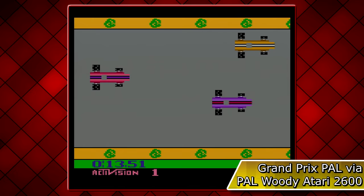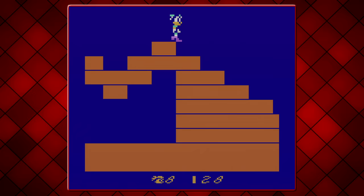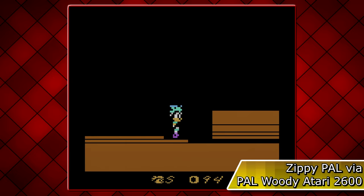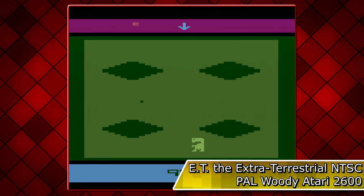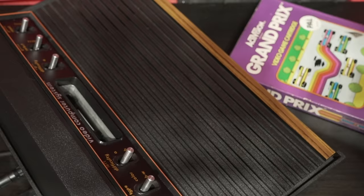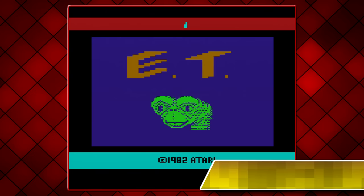It appears that putting in a PAL 50 game works as intended. Then, inserting any NTSC game, including Zippy, displays the wrong palette, as expected. But then, swap that for a PAL 60 version that still displays the wrong colours, which should not be happening. But now, all NTSC games have been fixed, which again, should not be happening. And it stays this way until you change the way the Atari thinks, by loading a PAL 50 title. Now all NTSC ROMs break again.